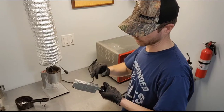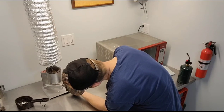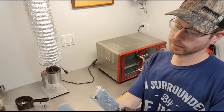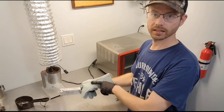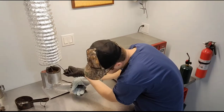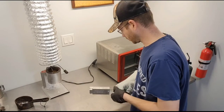I'm gonna pour these other ones that are not in there first to help heat the mold up a little bit more. I just goofed it — I didn't put my glove on. I'm still trying to get used to it, so try to wear a leather glove on the hand you're putting under the lead pot because the back-splashes hit your hand. Try to wear a longer one so it covers more of your arm. We all goof sometimes — I try to do stuff as safe as I can but some things get overlooked from time to time.